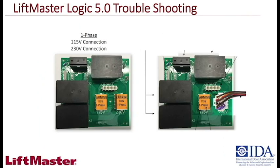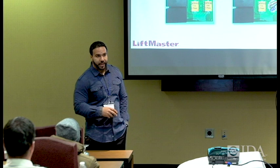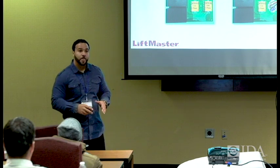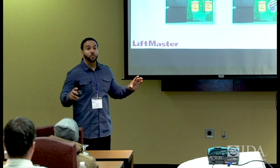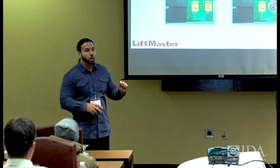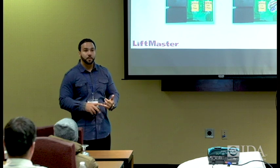All right, I want to go back to this for a second. You don't see 208 up here, right? Okay, that's because no operator in the industry is truly rated for 208 volts, okay? Not single phase. Can we do single phase 208 volts? We can, but you need to make sure you watch it because the variance changes slightly. You have your 8 to 10% variance of plus and minus. However, if I have 207 volts standing voltage and I have a door that is maybe not sprung properly, and we go to lift that up and that voltage drops to 202, 201, 205, whatever, your amps are going to spike. And guess what? You're going to start burning the motor up. You're going to burn up the relays. You can lose the brake.